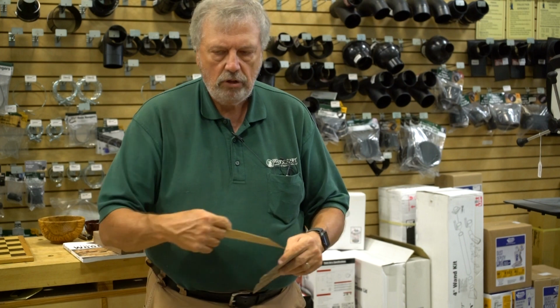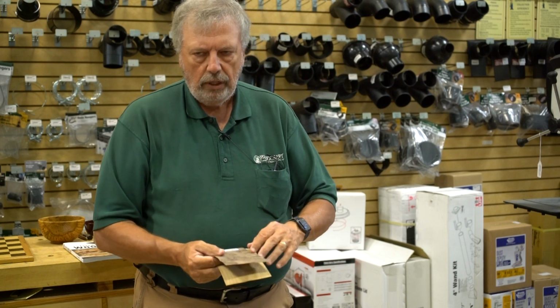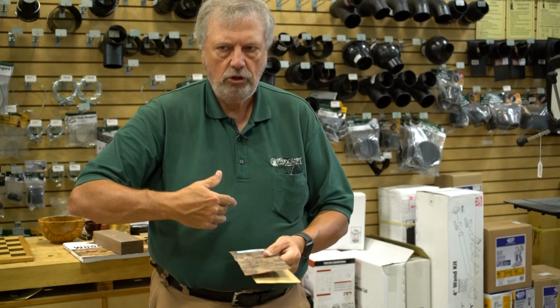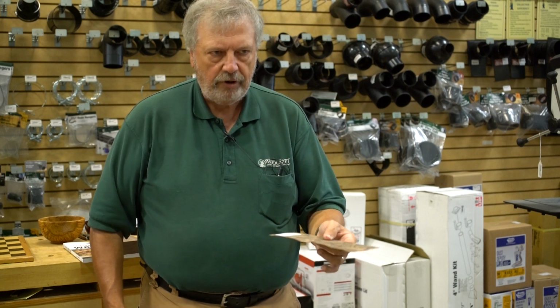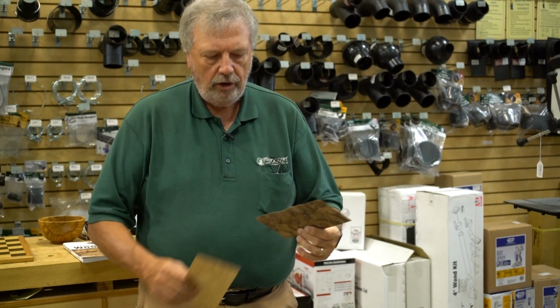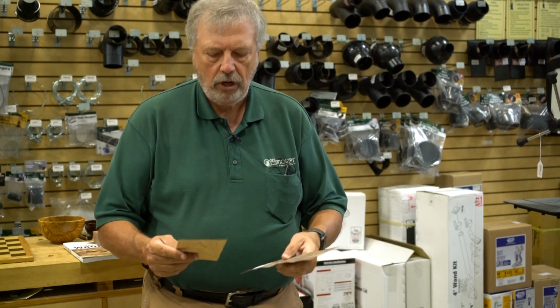And to flatten them, you use a veneer flattener. You put them between pieces of plywood with some paper towels, and you compress the snot out of them, and you do it over. And then they'll be flat. You've got half a day to put this on a board with glue, because after half a day, this is going to dry out enough, it's going to start to curl again. And if it's curled, it'll never be flat. The wood will split, and you'll have a terrible veneer.